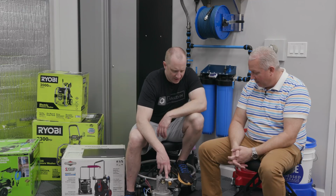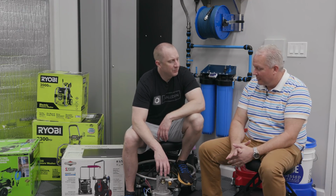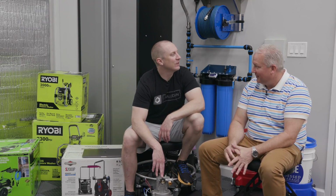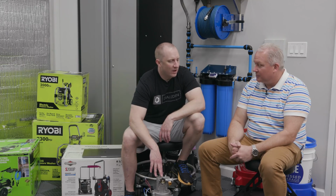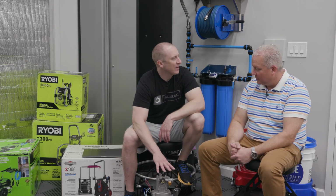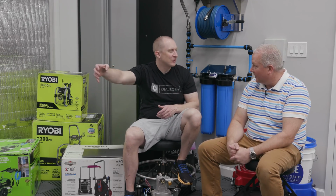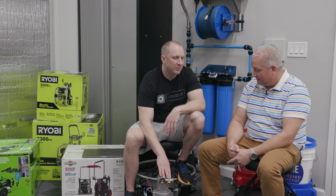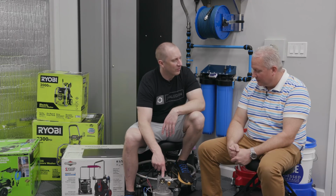And then pressure on the head. Now, I would think, correct me if I'm wrong, but thinking about horsepower and torque, let's call flow equivalent to torque. Right. And flow, I would say, now different than a car, but sure, I would wager that flow has less drivetrain loss than pressure. So when I say drivetrain, hose, gun, nozzle, right, debris, I would say that there's a bigger difference between real world pressure and what's measured at the head versus real world flow and what's measured at the head. Am I thinking about that correctly?